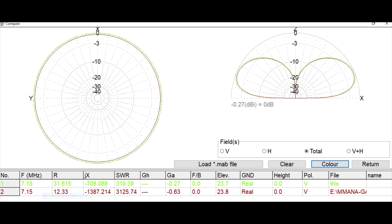So the key question now is what is this going to do for 40 meters? Let's compare 40 meters. It's a game of spot the difference — because as you can see from the far field diagram, between the red and the green, the 40-foot, 12-meter doublet compared to the seven and a half meter doublet in red, there is practically hardly any difference at all in gain or in the gain at different angles. We've got a dead heat. So if we just took the far field plot by itself, we'd say what's the point of going to a longer doublet? But that's not the whole story.